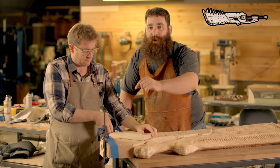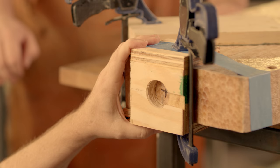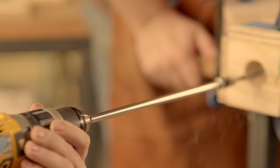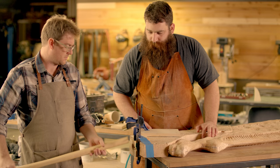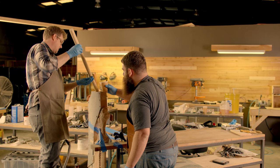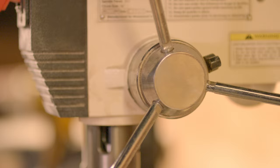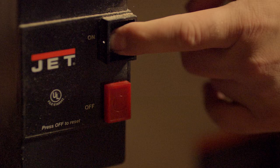We've decided where our center hole is for our handle. He's going to drill the hole because he's a lot more skilled and I don't want to screw this one up — this is one you really can't come back from. Marcus has drilled the starter hole with a Forstner bit, but the Forstner bit is only about three inches long, so he's brought in this monstrosity to drill the rest of the way. We're backfilling this with a little bit of epoxy resin and squeezing the shovel handle down in there. This is our octagonal piece — using a drill press with a Forstner bit to core out the center, then taking it to the table saw at a 45-degree angle so it ends up as a perfect octagon.